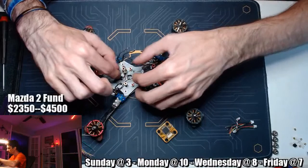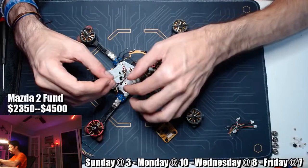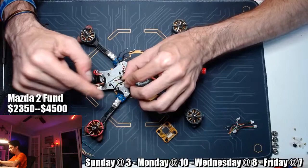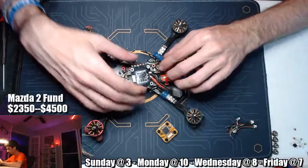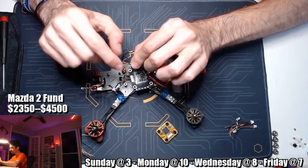And then we've got the camera cable here, which is being powered by the 5-volt out on the VTX, and then we've just got a little video in to the flight controller here, and that's it. Those are the only... No, that's not true. There's another wire bundle tucked away and hidden from the Crossfire Nano here that's going to need 5-volt, ground, RX and TX, and I don't know which one is which, so we'll have to look that up as well.